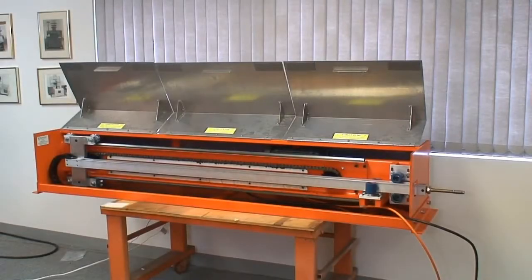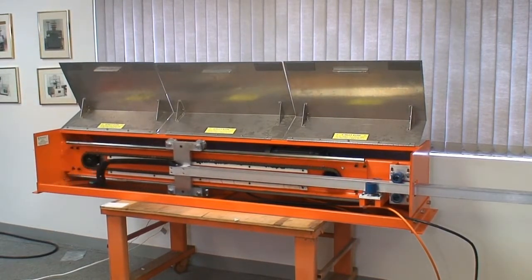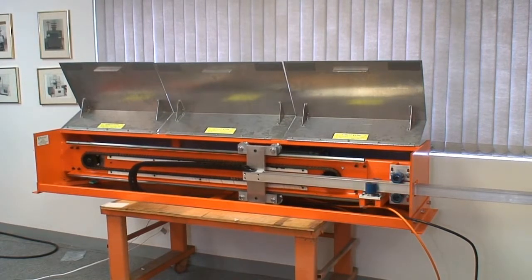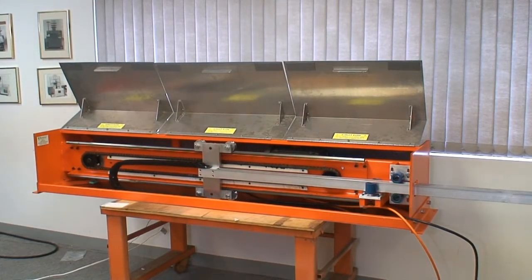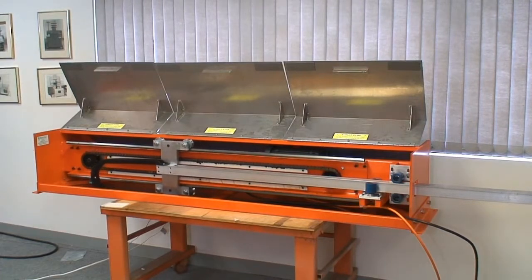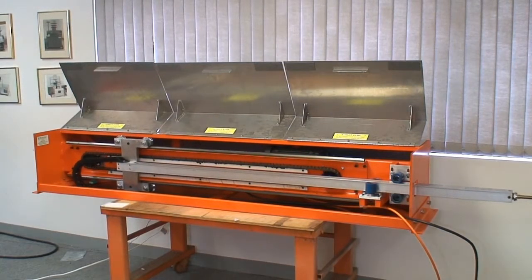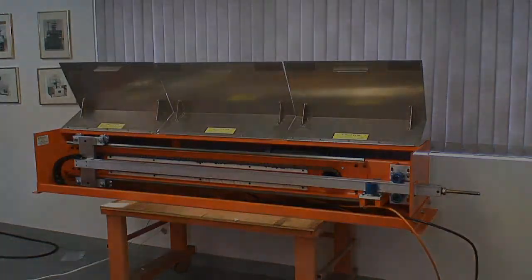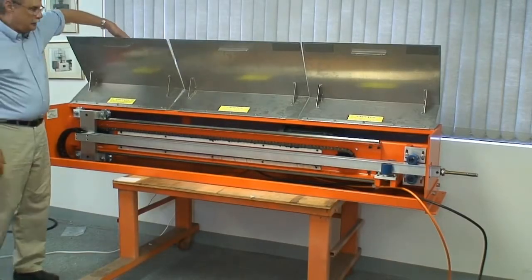I've just changed the on distance to 56 inches, the full stroke, and we'll run it again. Out at high speed, but this time the direction didn't change and the return stroke is still in the same direction, but the turn on and turn off points are at exactly the same positions to give the shortest possible cycle time for this machine. So basically, that's what's inside.